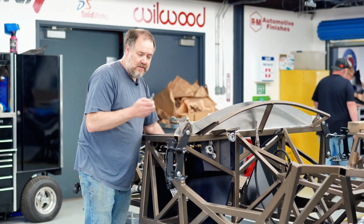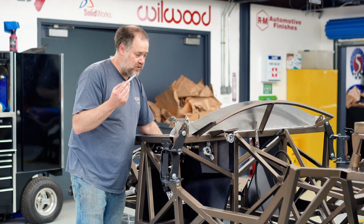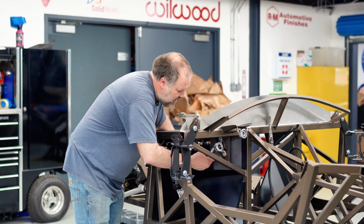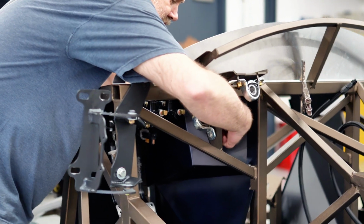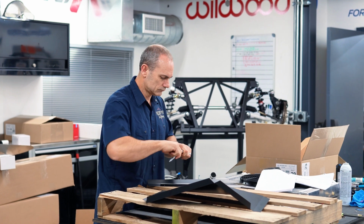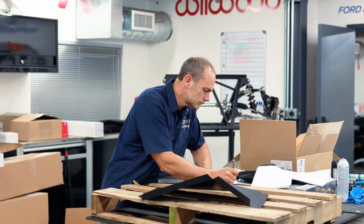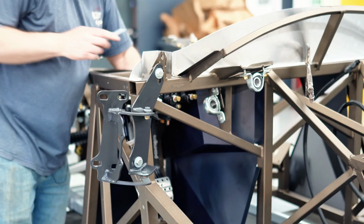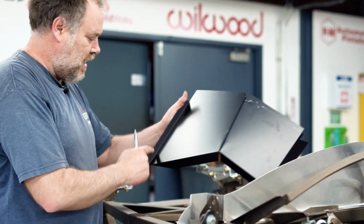We put the aluminum in place. What we're going to do now is mark it. With this car, the aluminum being anodized black, we have to switch to a silver Sharpie, which does contrast well enough with the panels. So basically you hold it in place and mark from the back side everywhere that there's going to be rivets. That way you can take it off and draw your lines and know where your rivets are going to be. This piece doesn't have too many, so just like that. And then we know the rivets are going to go along here, along the top, and along the front.